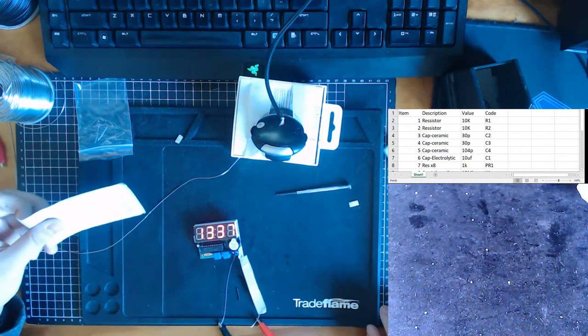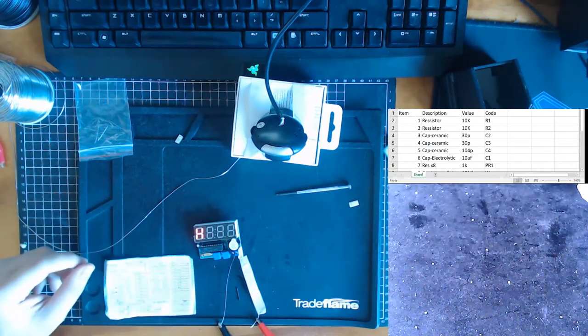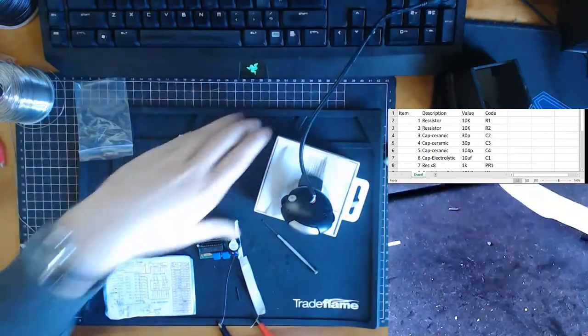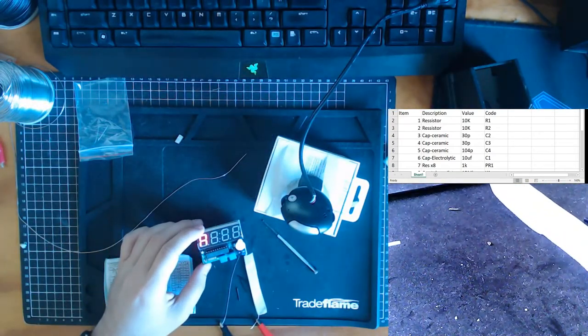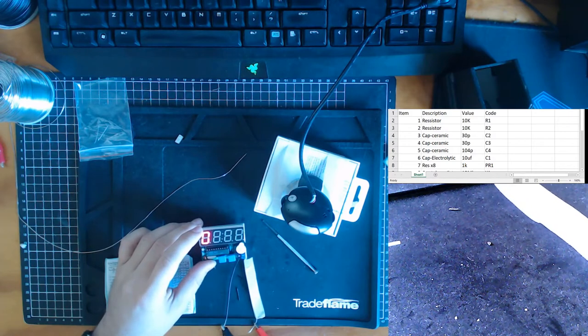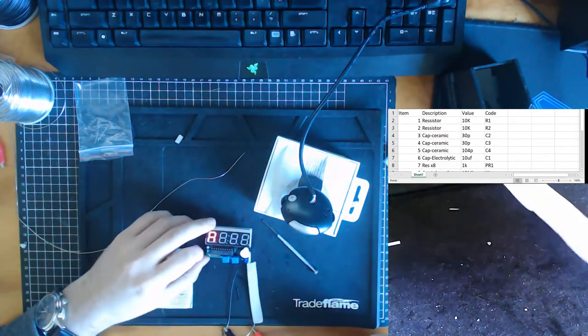Alright, so now we've got to find a way to actually code this thing. Let me see what happens if I bump it up to 9 volts, by the way, in case you're using a 9 volt battery. Alright, so it will work on the 9 volts. Just the light will work, but the voltage is too high for the piezo. It also seems to be clicking through the things very quickly, so it's not ideal. It's funny, the lower the voltage, the higher the pitch. Looks like something from a video game.